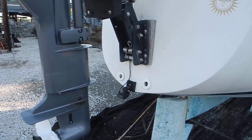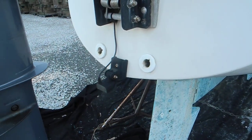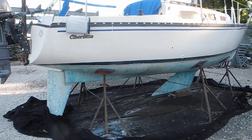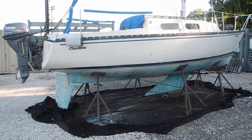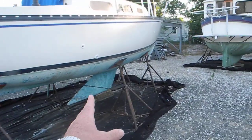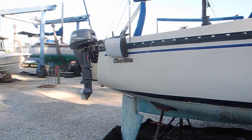As a side note, look at this — this is the depth gauge transducer that's bolted onto the back of the boat and sends a depth gauge signal down. Looking at the entire boat, I'm assuming this is about 25 feet, so your depth gauge is about 25 feet too late to tell you how deep the water is. That's a simple, economical installation, but it would be better if it were put up at least where the keel was, or forward of the keel, to give you true water depth if you're idling around trying to anchor.